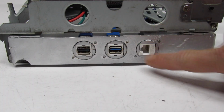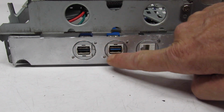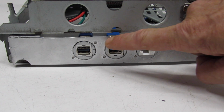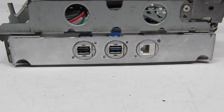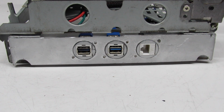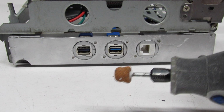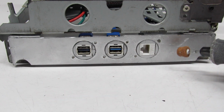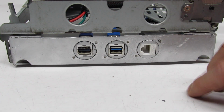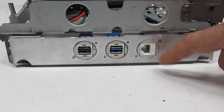There. Okay, remember I told you that these took 2.5 hours to cut out, these 3 holes? And look, they fit perfect. Well, what I did was, these are about the size of a quarter, and so I traced out a quarter, and then I don't have a 1-inch drill bit, but I do have this 1/2-inch drill bit, drilled through there, and then I used my router bit, and I went real slow, and I went through probably 3 of those bits doing it. It's 16 gauge sheet metal. I got this so it wouldn't flex when I was unplugging and plugging the cords in, and this stuff is really tough. If I had a CNC controlled plasma cutter, this would have only taken maybe 2 minutes.